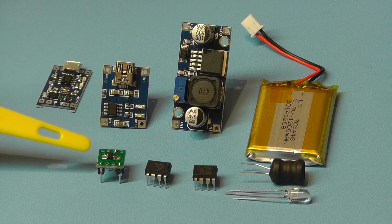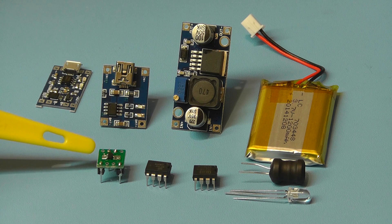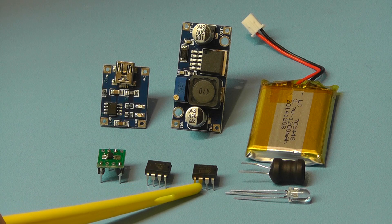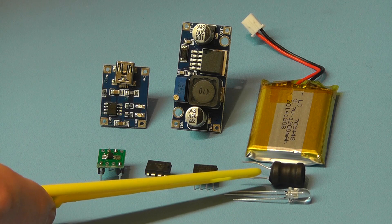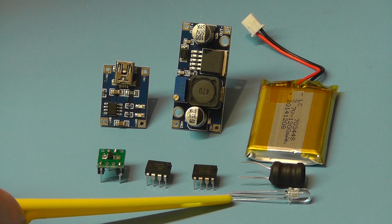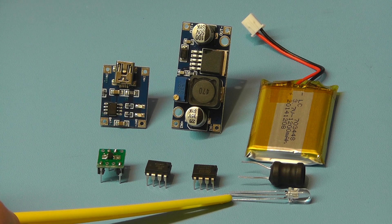The other main item is this little tiny three-pin IC - the voltage supervisor IC. It's so small I've actually mounted it on a small PCB module which allows me to add pins that I can connect to the rest of the circuit. The voltage reference IC is the REF102C and the other is the INA105, the differential amplifier with the laser trimmed resistors built in. We also have a 100 micro henry inductor and the bi-colour red-green LED which we'll use to indicate when the unit's on and also when the battery needs charging.